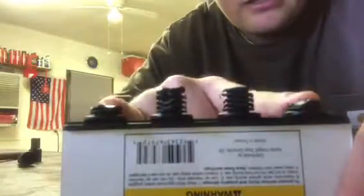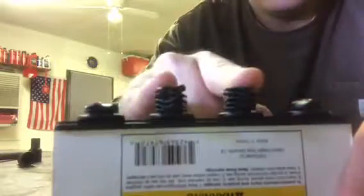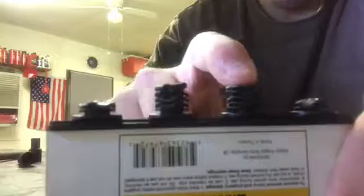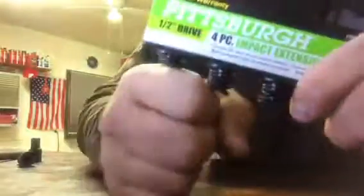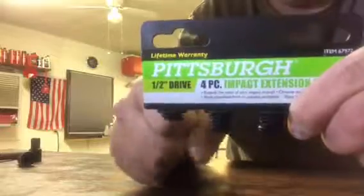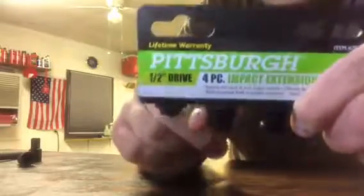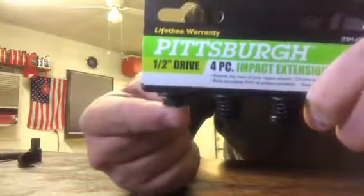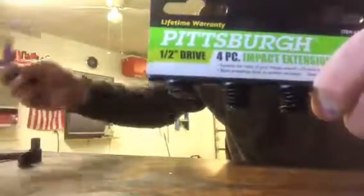There's nothing left in there — just set that to the side. I've had two come out broken and two that didn't. To avoid breaking them, don't just pull them straight off. Turn them sideways — especially for the ones from Harbor Freight. Take the socket and wiggle it back and forth while pulling down, so it doesn't break off at one of the rivets, and it comes right off.